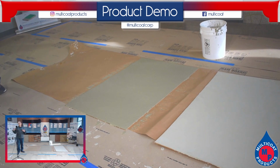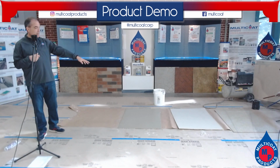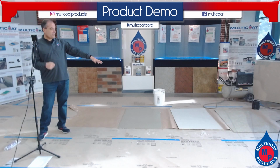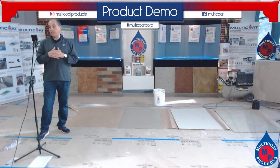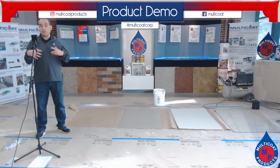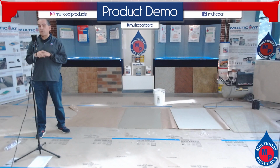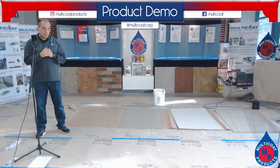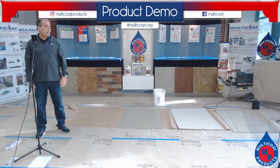And what we recommend typically is doing a base coat and then following it up and doing a texture coat. So what Alfonso's going to do next, on the next board, he's got a base coat on there. He's going to come back and do a texture coat. We sell the Sharpshooter hopper. Depending on what kind of hopper, if you're doing this kind of texture, we recommend the Marshalltown Sharpshooter. We sell it to a lot of our distributors. You're welcome to contact us or your preferred distributor on how to get a Marshalltown Sharpshooter.